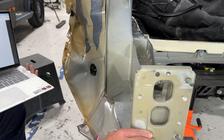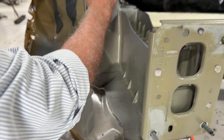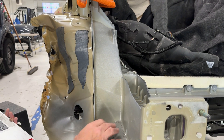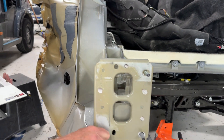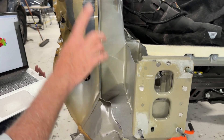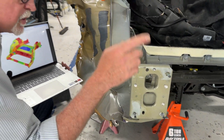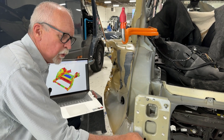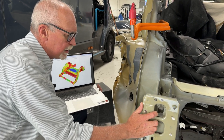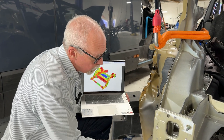As we look at this area of damage, this is cast aluminum and we're looking to see if there are any cracks. Cast aluminum may bend a little bit, but in most cases it just shatters — it breaks. We have measured this vehicle using digital 3D measuring systems from prior videos to confirm that all of these control points are in the right position in space. So we know that on this one there is no movement in the gigacasting.